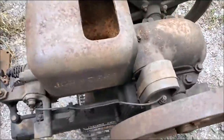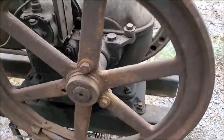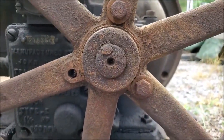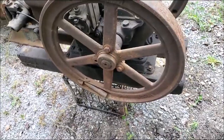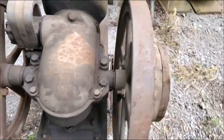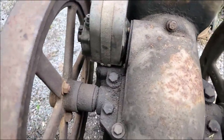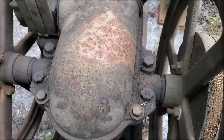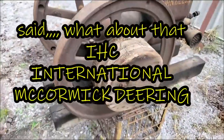It does have a pulley on it. I'll probably have to get that key out of that flywheel right there. If you're going to start with one piece you have to get that key out of there. You have to get that key out of one side in order to set the side plate — you squeeze your flywheels together up on them babbit bearings right there to take that side plate out.